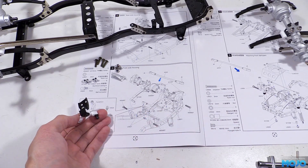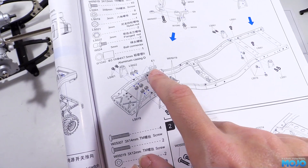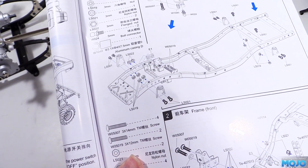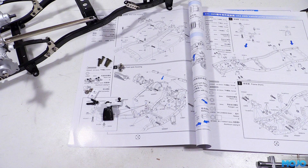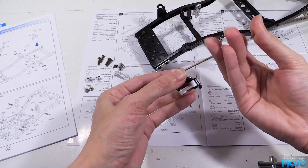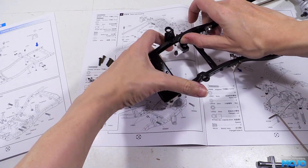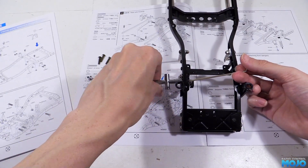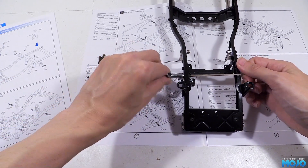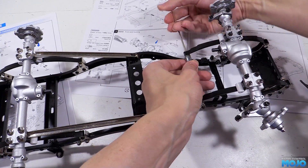The next step with the bell crank was somewhat of a mystery, as the main diagram is already fully fitted. After some thinking, I remembered that as well as the assembly manual, there's also the full build manual. It looks like the bell crank mount is fitted during part of the chassis assembly - a little mistake missing that, but at least the info is there if you look for it. So we will be needing a couple of M3x12s, two M3 flange nuts and a plastic part E1. E1 is basically just a spacer that goes between the mount and the inside of the chassis. With the spacer fitted on the mount, we can offer the assembly up to the chassis just behind the upper damper mount. Then from the outside, we fit the two flange nuts and tighten them up with an allen key and a cross wrench. Now we can fit the axle to the chassis using exactly the same combination of aluminium tubes, screws and nuts as the rear.